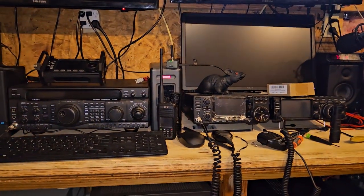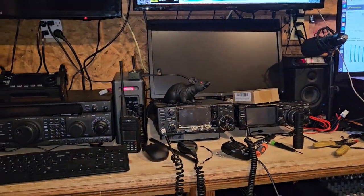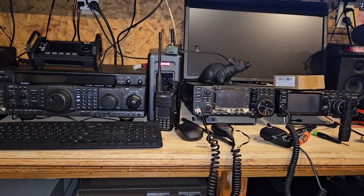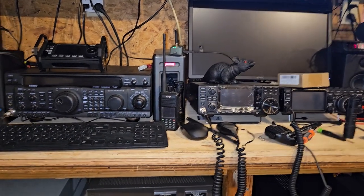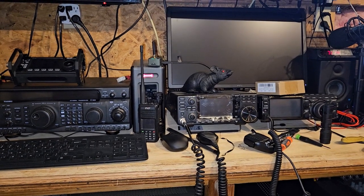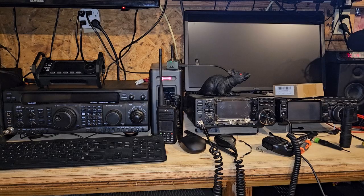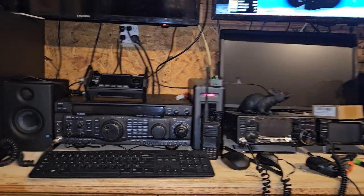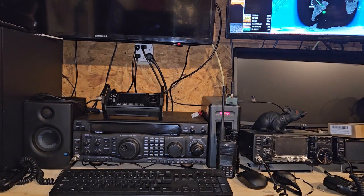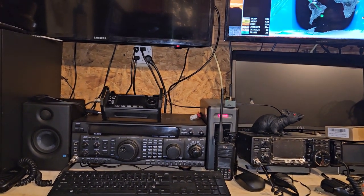And with these radios with USB ports on them, you're really, really asking for trouble, because I've already seen it happen on a 7300 that I had in 2019, and the USB port quit working. I'm not 100% sure that's what happened, but ICOM was pretty sure that's what it was, and they weren't willing to warranty it or do anything about it. It usually only shows up when you start to run power too, so that's the other thing.